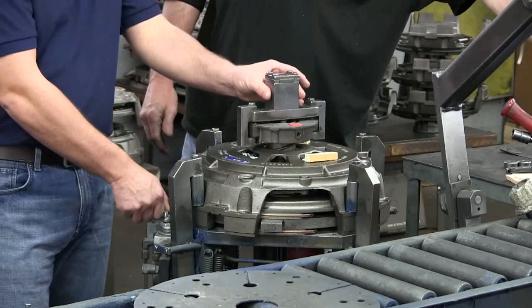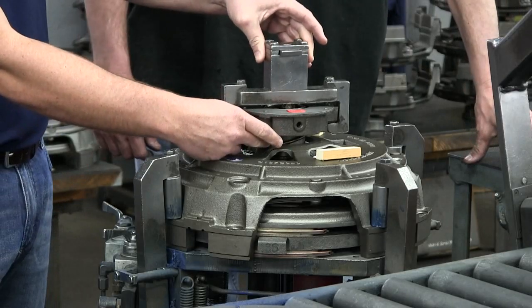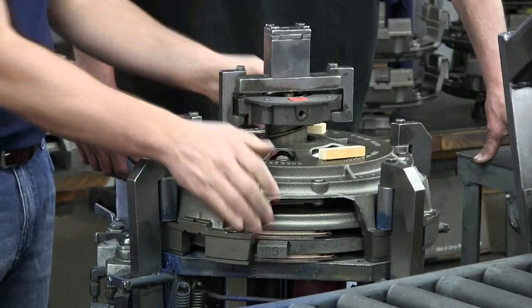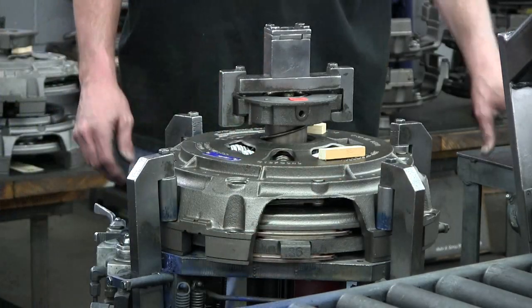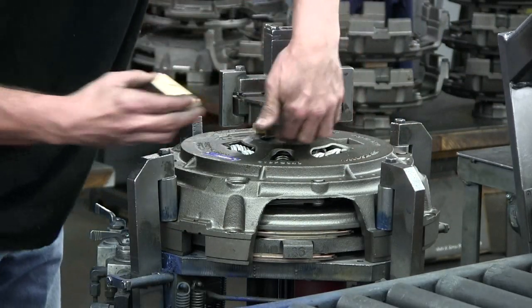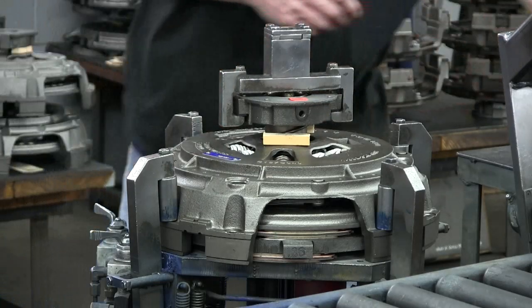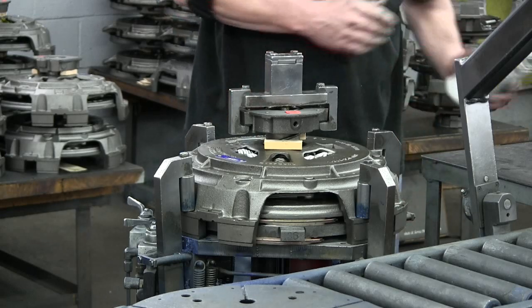At this point, your gauge is flush, so you've got your half inch underneath the housing and it's pulling it back half an inch. Check for release. It's got a ton of release, working properly. He marks the adjusting lock so we can tell if it's been tampered with.